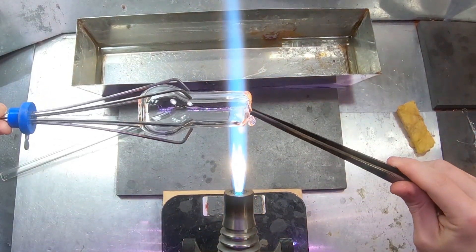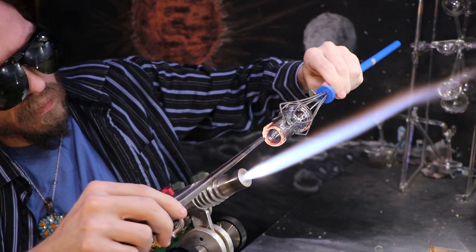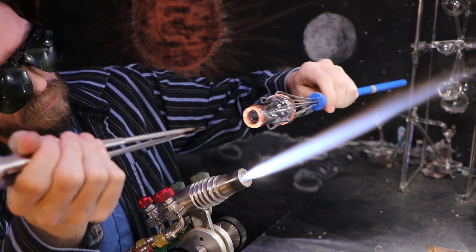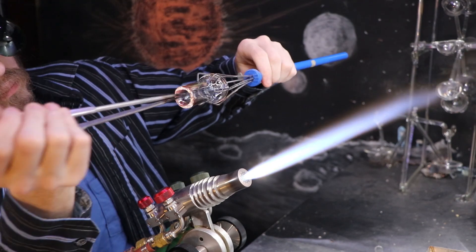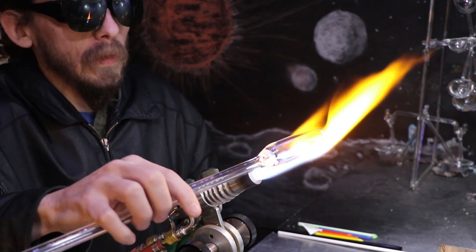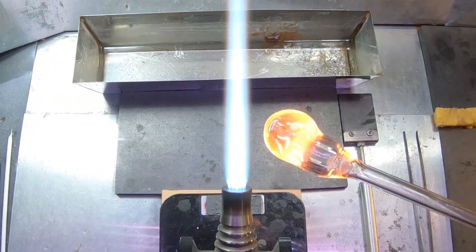I removed a little bit of glass and I'm gonna move some glass around to help balance out the lip here. I could have blown the vessel out a little bit larger — I left the walls a little thick, about 4 millimeters. But they should be a good size for a single dose potion. To make it more of an apothecary set, I'm gonna make one more vessel to mix the potion in.